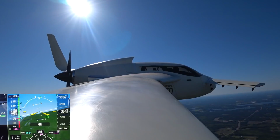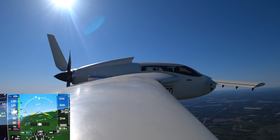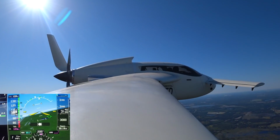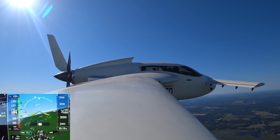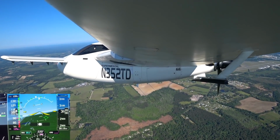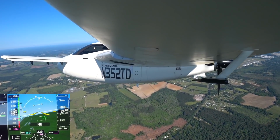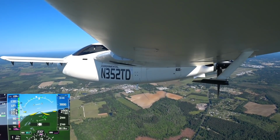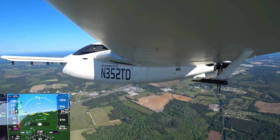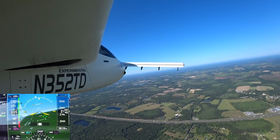And around about the same time, the low oil light was coming on more. It was still going off again. So it just made me think that the oil has got to a certain temperature now where it's gotten thinner and thinner, and it's running through that redrive more quickly, and subsequently pulling down the oil level, because the amount of oil that I have in there now is basically the same as I was running on the previous engine and also with the previous oil collar in there. But for whatever reason, it's just not holding the pressure as much, and obviously, a different oil collar in there, the bronze one.